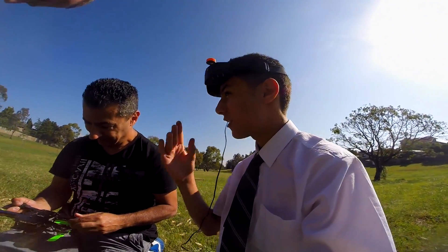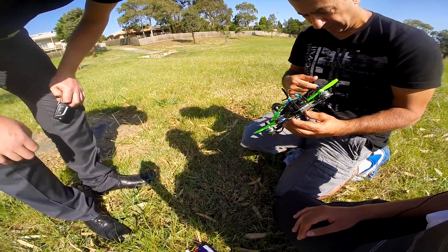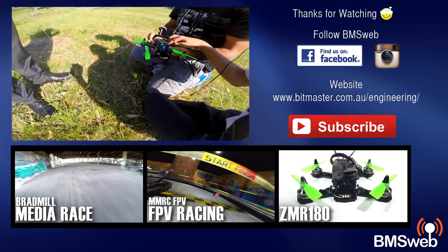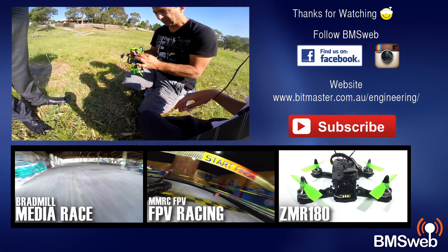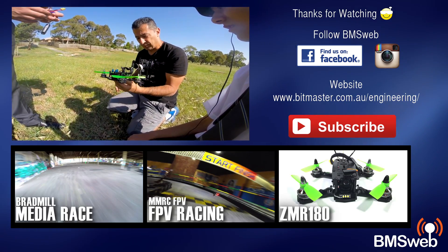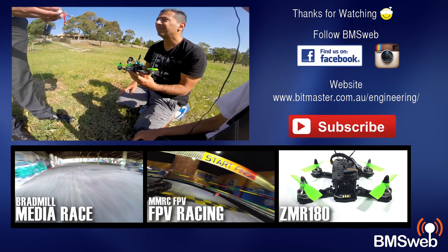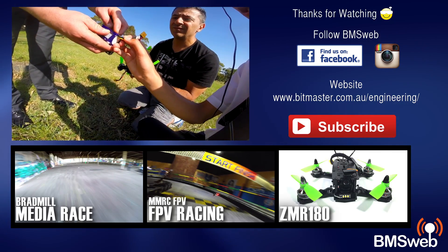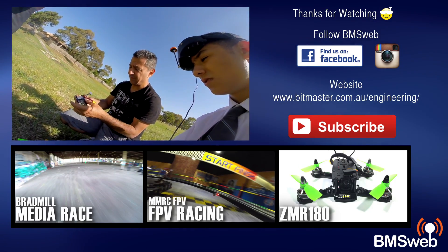Actually, technically three. You did have a good run before that. I reckon you just blew an ESC — it had to be. Is there any melting? You've got to take them off at home and touch them — any heat? You'll be able to tell whichever one was smoking. One's cooked for sure, because I could smell it — smell the magic smoke. One of them's cooked for sure. We'll find out when we get it home. That one just copped a scratch on the cell. Is the cell damaged? It looks like it got sliced along that side. Probably not safe — I'd leave it outside overnight and see if it loses voltage.